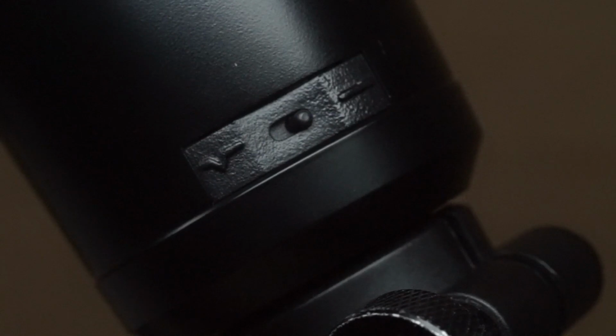Now, the Heil has no switches to it. Just straight up cardioid. There's no switches, buttons. There's nothing to it. Interestingly, the RE320 does have a switch on it, and it's essentially a different EQ curve. Now, in many microphones that we've tested, you often get like a bass roll-off switch, and that's to get rid of rumble and some of that low end. This one, interestingly, it's not a bass roll-off switch. There's essentially like a bass notch.